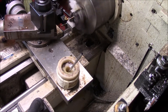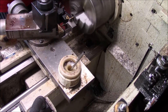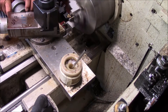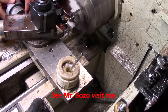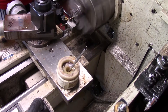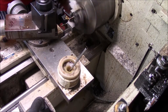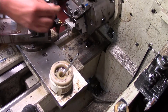I pick this one number constantly — that way I don't have to think about it. I don't thread every day, and if I did, it'd be a little different animal. The gentleman at the machine shop I worked in threaded and hand-ground his threading tools. When you touch off, you don't know exactly where you touch it. This should get me close — I should be starting now, or I should have a halfway start. And that's the danger. You see right there? That's what happened. I may have cut too much relief, and I'm not even threaded.